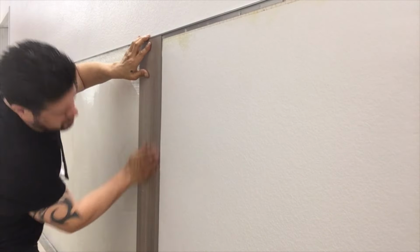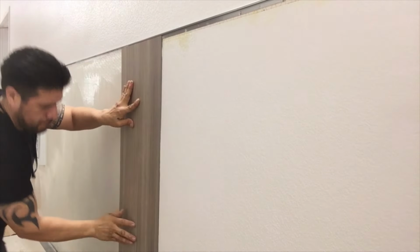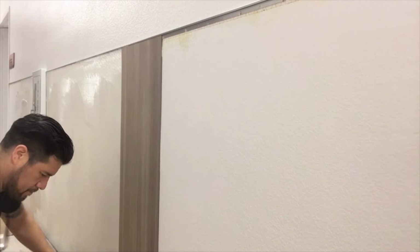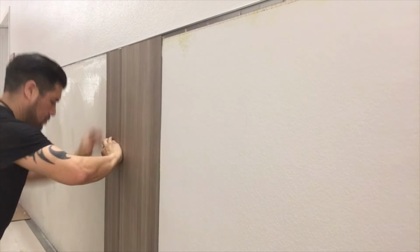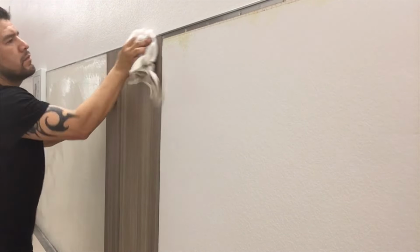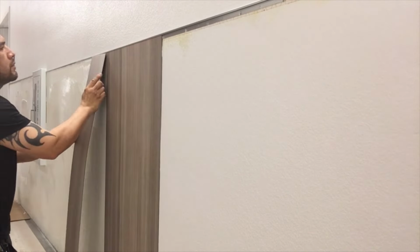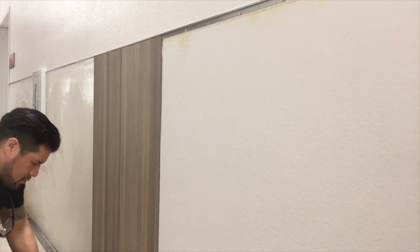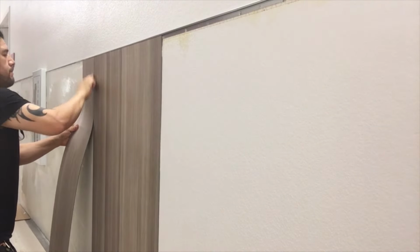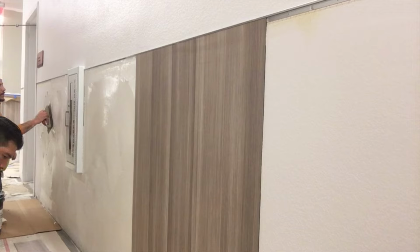Now that we have our line in place, we are going to spread adhesive, which we used a 373 premium adhesive, and on our trowel notch size, we used a 1/32 depth by 1/16 width with a 5/64 spacing, which if you are familiar with an Armstrong trowel, it's going to be the smaller side teeth. So again, you're just going to want to place your first tile right on your line, keeping it nice and straight, and then you're just going to be applying tiles really snug until you get down to where you're cutting in.